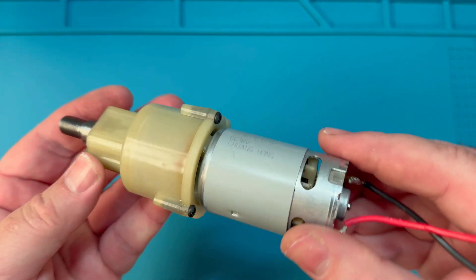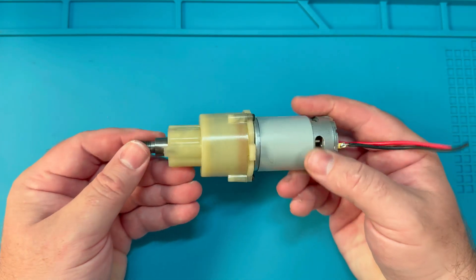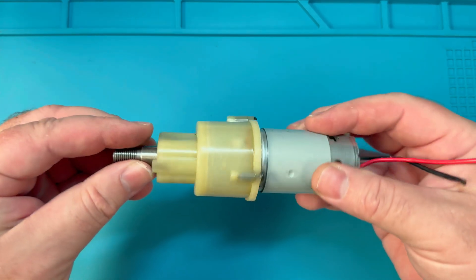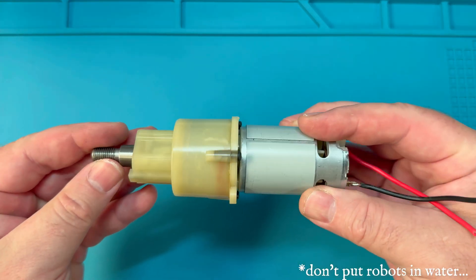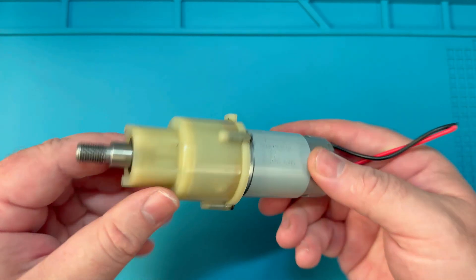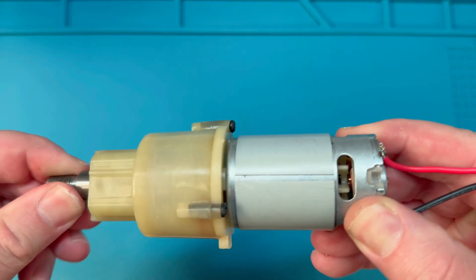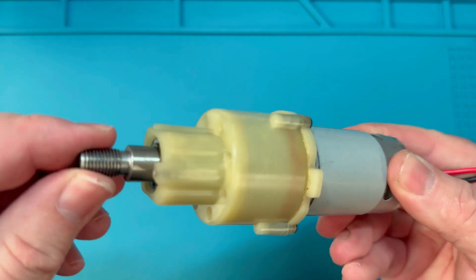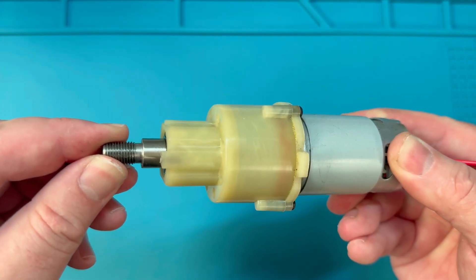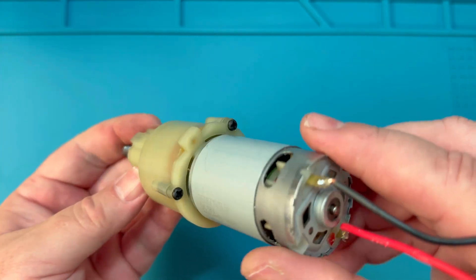Plastic gears will still work, but in robotics where you're likely going to be throttling and applying maximum torque a lot, there are scenarios where plastic gears will simply shred and leave your robot dead in the water. Given the intention is to use these motors for robotics, we essentially want the motor to deliver all of its available torque or brake trying. Although this motor has been stripped of its chuck and clutch system, it can't be used as-is — if you turn the shaft, it turns freely because the internal gears aren't being engaged without the clutch system.